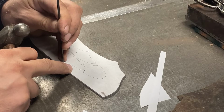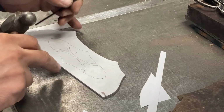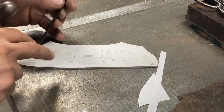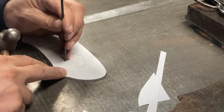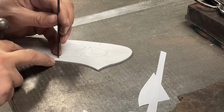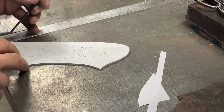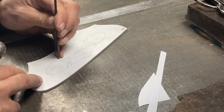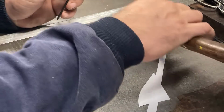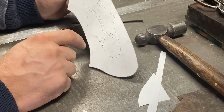And I'm using polycarbonate for the pattern here. It's a plastic, and it's thin, it's 1/8 inch, so it's easy to generate patterns in it. It machines and cuts pretty easily. But specifically for center punching it here and things of that nature, it's better than acrylic sheet. I think I've found acrylic sheet to be a bit more brittle. So this polycarbonate sheet being a little bit more tough will put up with more abuse, put up with drilling better, punching better, and then you won't have cracks in your pattern through the thin parts. That could be a real pain.